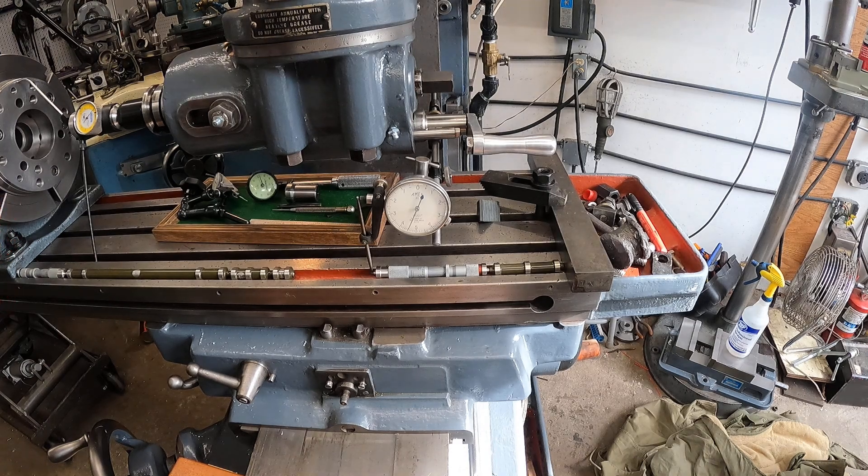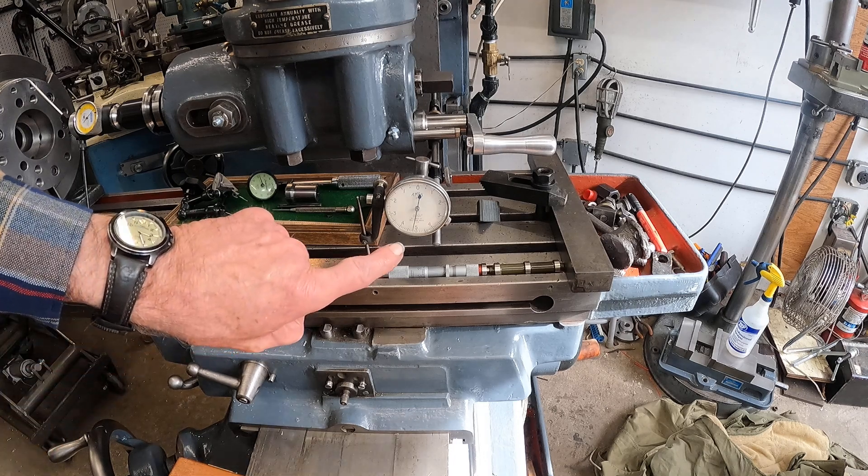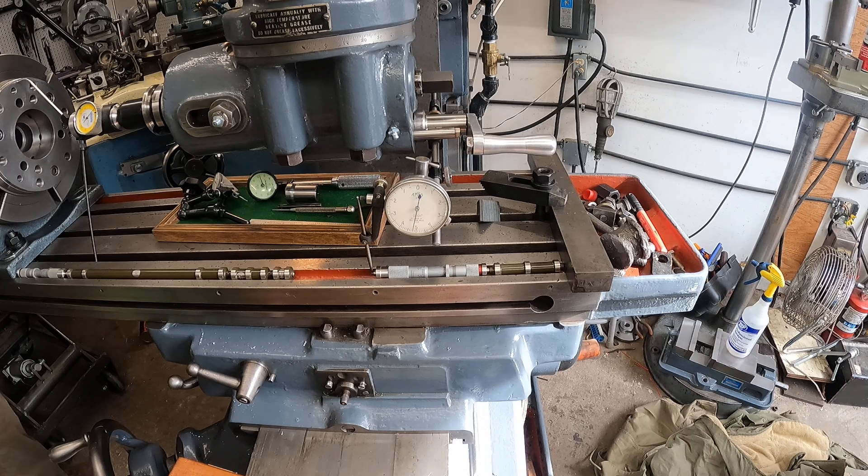For high precision, you really can't go by the table dials — you've got to do something like this: set up a dial indicator with end measuring rods. I'm going to try to repeat this a couple of times and try to hit on that five. It's hard for me to see very well from here. Let's try it from there — there we go. I'm going to stop a couple of tenths before five if I can.